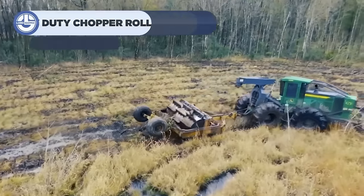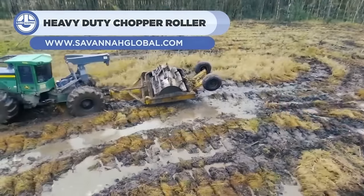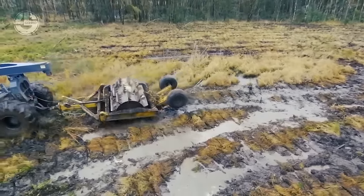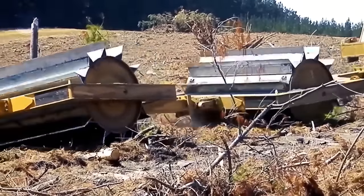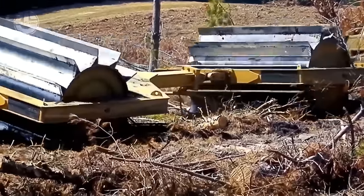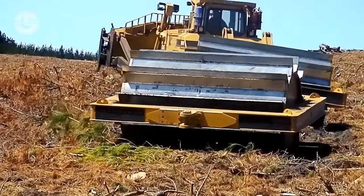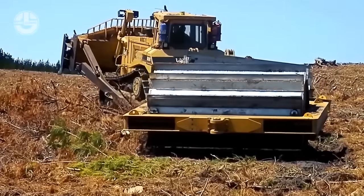The roller chopper is designed to roll down and cut brush and trees up to around 3 inches in diameter. It will also break down some shallow roots. These are big, but they can easily be pulled up with a prime mover, usually a skidder. The drum can be loaded with extra weight water. Multi-drum versions have 2 additional blades on the rear drum to avoid tracking. These arrangements are recommended for the cutting and killing of light to medium growth. Preparation of the site has never been so straightforward.